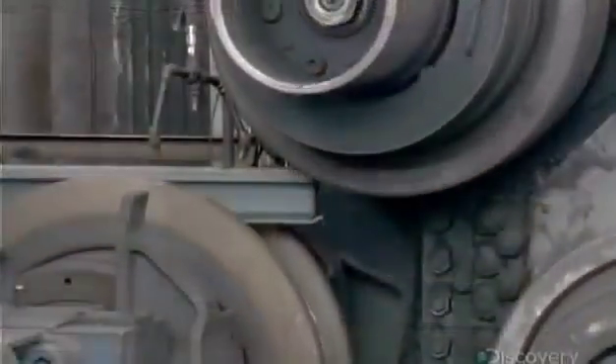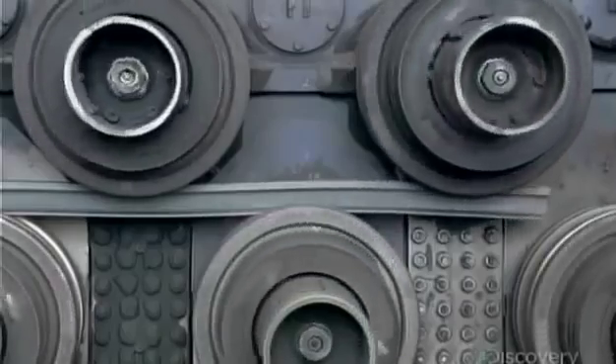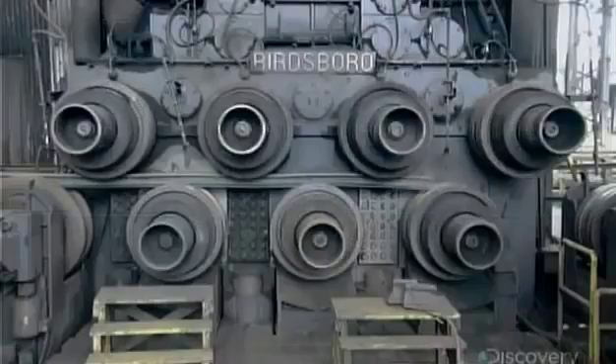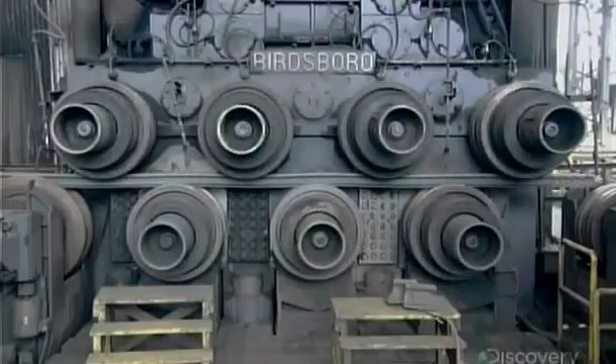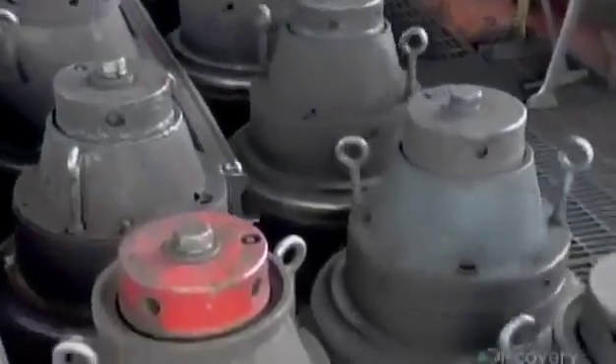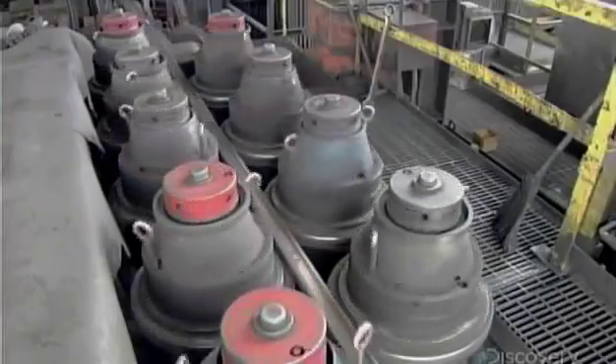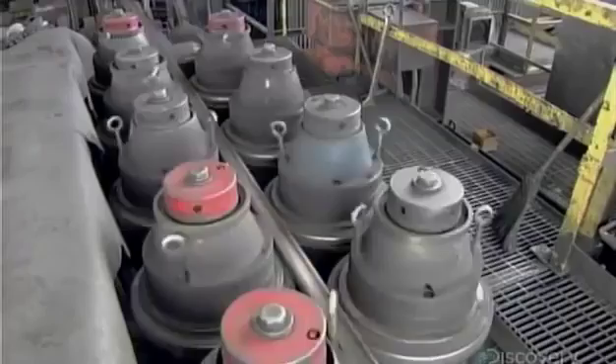When they come out of the box, they run through two sets of rollers. The first set flexes the rail vertically, the second horizontally. This flexing process straightens out the rails, which curves slightly due to all that heating, shaping, and cooling.